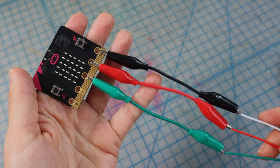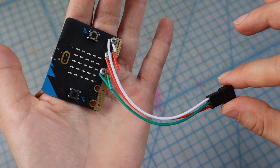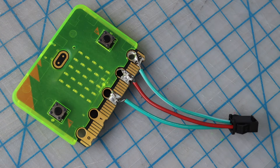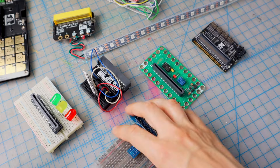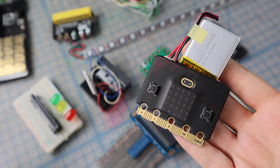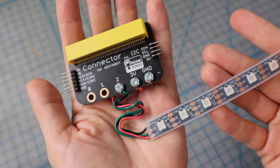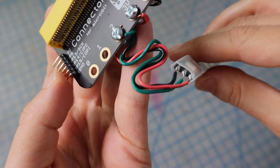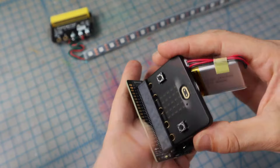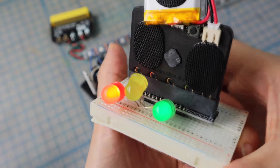To connect the microbit side, you can create your own alligator clip connection, use screws and bolts, or solder to it directly — though I don't recommend soldering unless you never plan to use this microbit for anything else. Another great option is an edge connector. Edge connectors slide over all the pins on the microbit and are manufactured by many companies to expand what a microbit can do. This simple one has holes just like the microbit, allowing you to connect a NeoPixel strip directly while making it easy to slide the microbit in and out. Other types connect to motors, Lego, breadboards, and more.